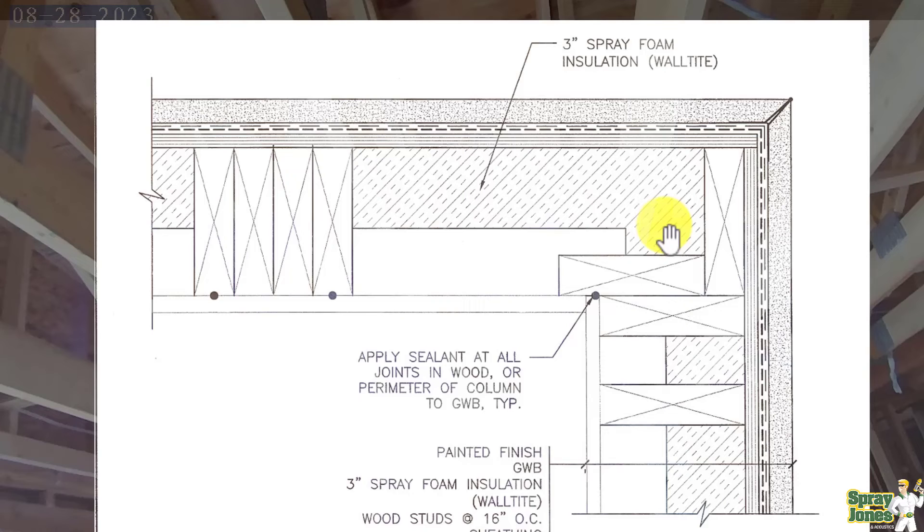Sometimes it can be hard to verify corner coverage, so you've got to make changes to the details — have things cut back. If there was another stud blocking your way so you couldn't rotate your gun in, spray foam installers have got to get things modified: have them cut it open, remove it, drill holes in it, and then sequentially fill the corner up. We've even had cases where we thought we got it and something got missed — a little pocket in the corner — and had to get some can foam in it. The point being: no vapor barrier is shown in the assembly.